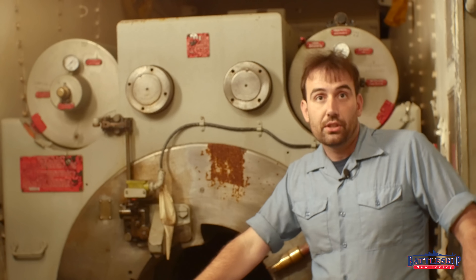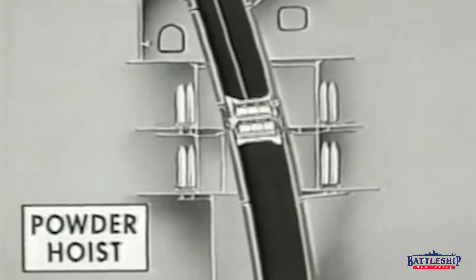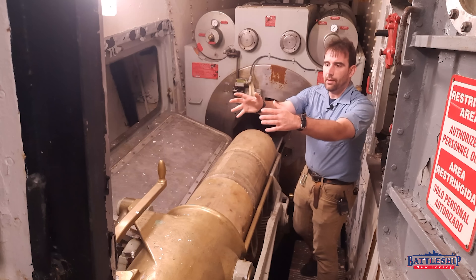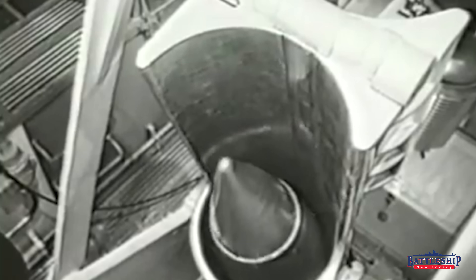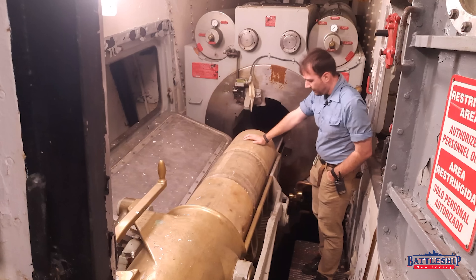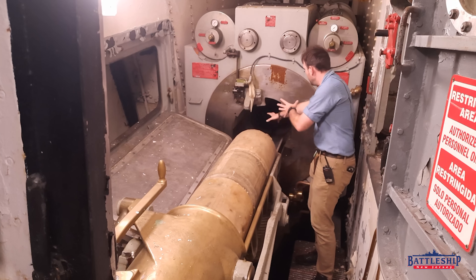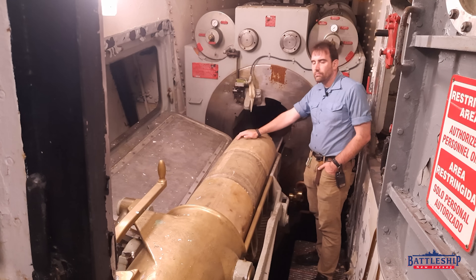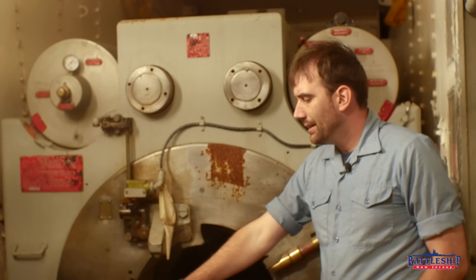The hoists for the 5-inch guns and the 16-inch guns run in reverse. So if I wanted to roll this powder back onto the elevator and send it back down to the magazines, I can. If the shell had been hoisted up this high in the open spanning tray, I'm pretty certain we could just run the hoist in reverse to get it down, along with the other projectiles that might be stacked up under it. However, I suspect your question is actually: can we pull this stuff out of the breech of the gun? And the answer is more or less the same for both the 5-inch and the 16-inch guns.